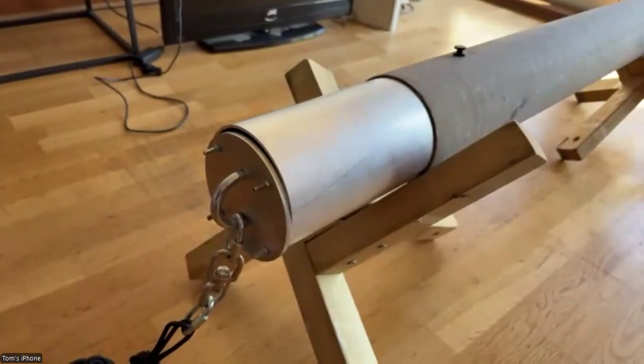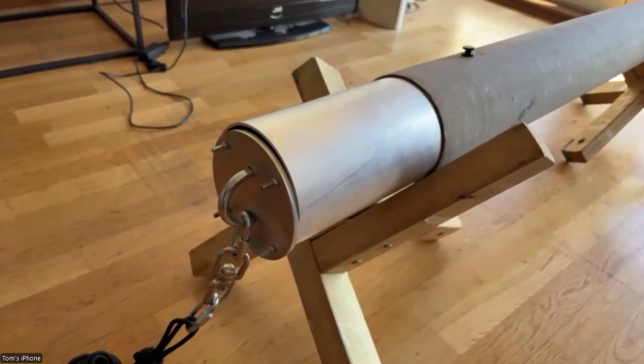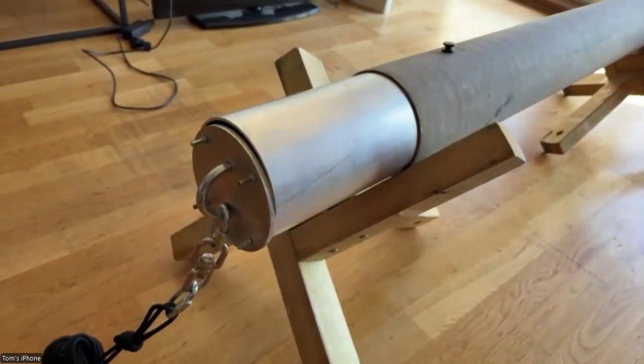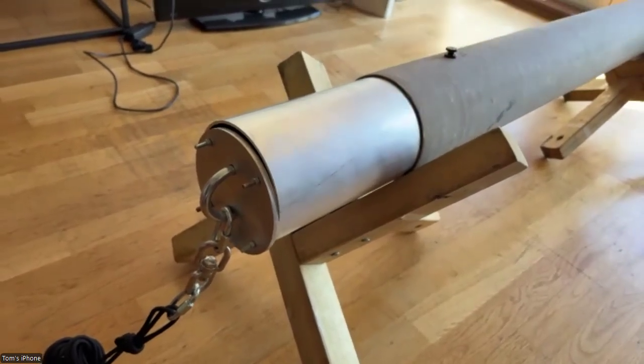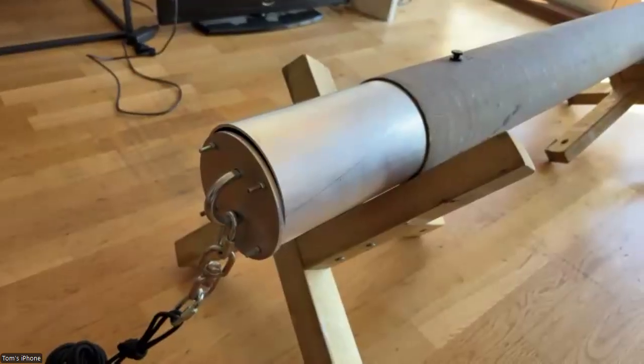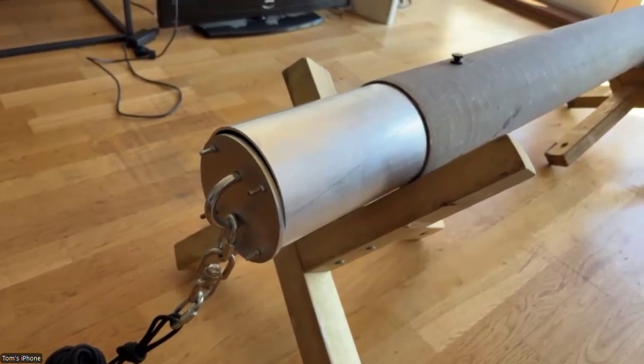How are you going to hold that in? You said you're going to put 8 screws in. Are you just going to do one ring of 8, or 2 staggered rings of 4? Have you thought about how you're going to do that? The current plan was just 8, because it's a secondary method of retention as well. The first one comes from these rods, because they run all the way through into the forward closure, so it's being pulled up from the motor at the bottom. Our plan was just one ring of 8, but 4 and 4 is equally viable, and we can definitely do that. I don't have strong opinions either way. I know some people like the staggered pattern. Yeah, we can definitely do staggered ones then. It makes no difference.